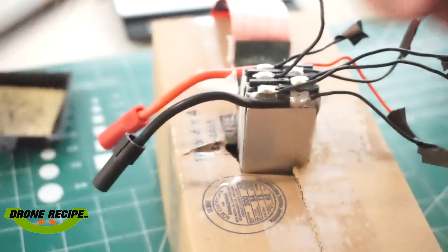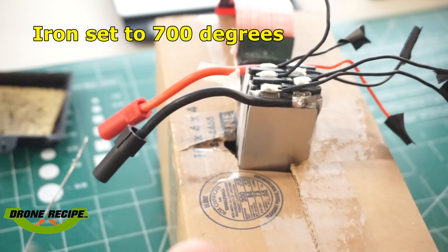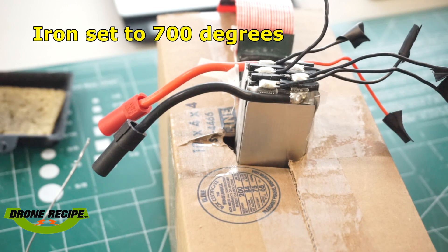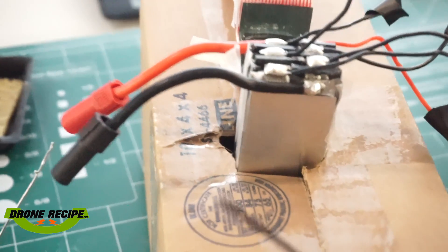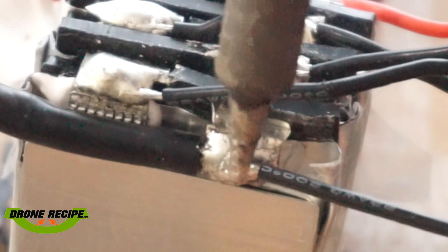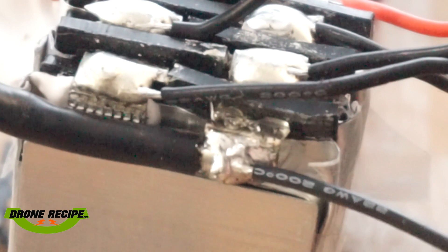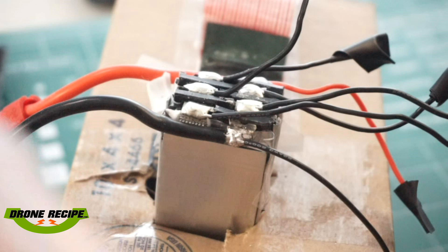I'm going to use a little bit of solder to get the heat transfer going — that's what we're going to do, and you want to be careful about the heat here. I just want to pause briefly to mention — because I don't do it in the video — that it's best practice to tape each wire with some Kapton tape after soldering it, to isolate it every single time. That way, in case your iron touches something else and you get a short, it's just preventative and good practice. I apologize I don't show you, but I do mention it.